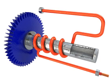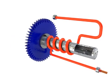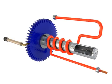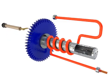When the heater coil gets hot enough to melt the inner eutectic alloy, it indicates that the motor has reached a dangerous overload threshold. At the elevated temperature, the alloy will instantly turn from a solid to a liquid, allowing the inner ratchet shaft to turn freely. When the wheel turns, it releases a pawl previously engaged in one of the cogs of the ratchet wheel.